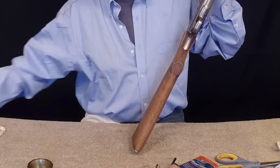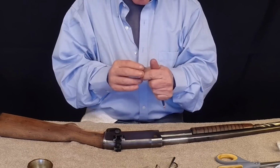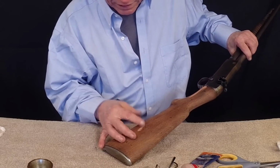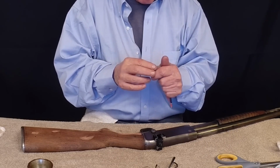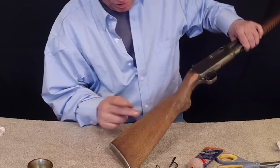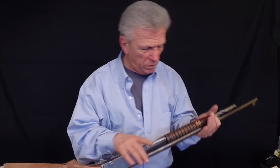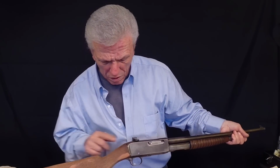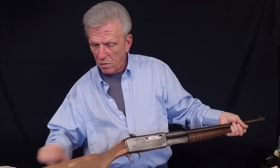Now this piece here, we're actually going to rebuild with the fill sticks. Now some of the larger parts that we see here, we're just going to fill those in too, because we'll be able to grain those in. Makes it a little easier when we have to fill less with the fill sticks. As long as we're doing some putty on it, we might as well get those bigger ones out of the way right away. Those are our larger ones. The rest of them will come back and we'll fill those in with the fill sticks after it dries. So there we go. And we'll set this one aside and we'll move on to that in about an hour.